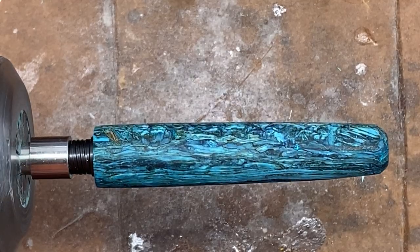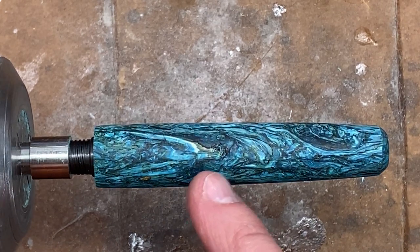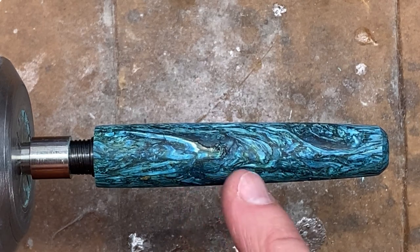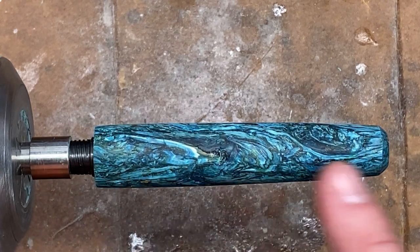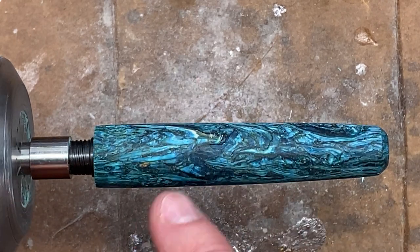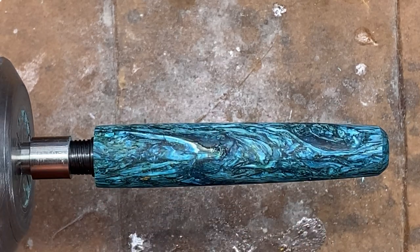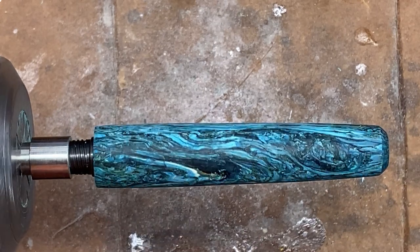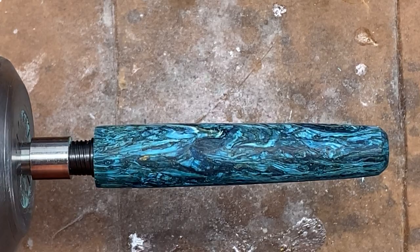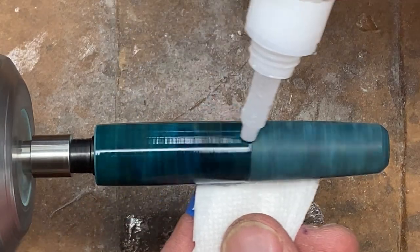Just finished micro-meshing my blank. I'm real happy with how it looks — I've only got the one spot where that leaf or stalk is giving away. I'm going to go ahead and put five coats of thin and five coats of medium CA, then I'll micro-mesh it and come back and check that spot. If there's any type of an indention, I'll apply a few more coats until I can completely level that spot out. We'll apply coats and micro-mesh until it's gone.